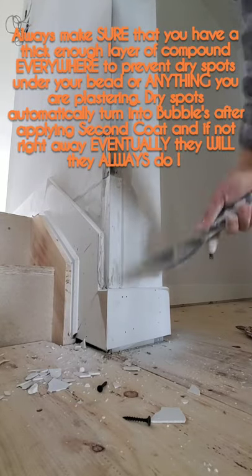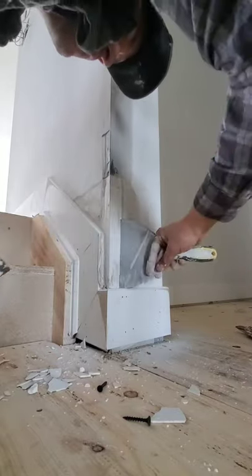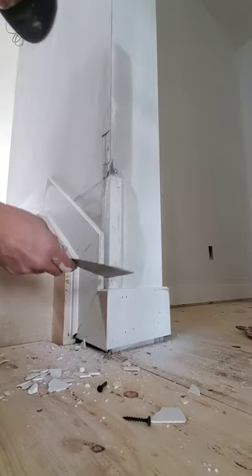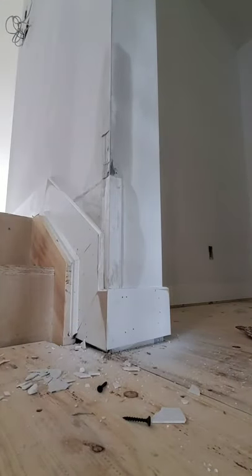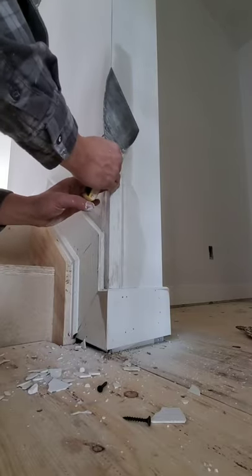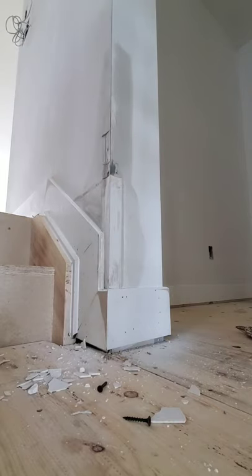Pulling the tape out. Pulling the tape from halfway down, out, and halfway up, out. That prevents crinkling and problems that you don't need. Once it's on, you want to make sure that that is lined up A1. So, let's see if it falls in a bit up here. If I leave it like that, that's going to be a problem to hide. It's going to be more work, which we want to avoid.